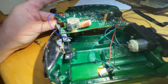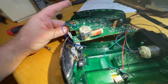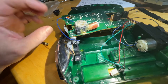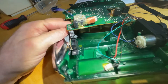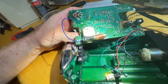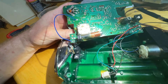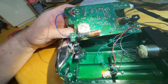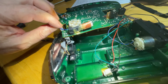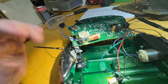I turned it on and cleaned the potentiometer and everything. This capacitor here is sealed — I thought it was scratchy, but as soon as I work around it, it works just fine. It's not scratchy, and I think the broken antenna was flopping around and touching stuff, because that's the sound it was making every time I turned something.